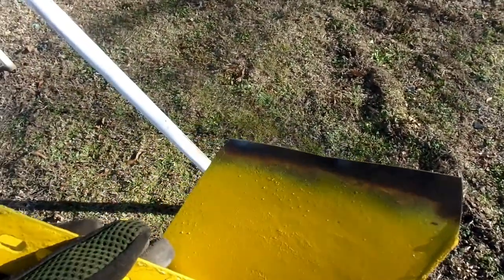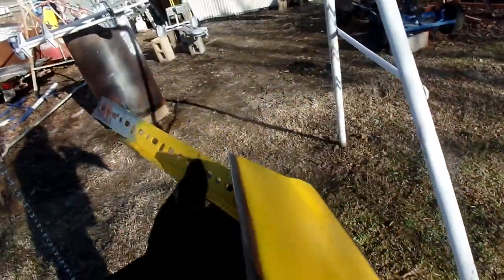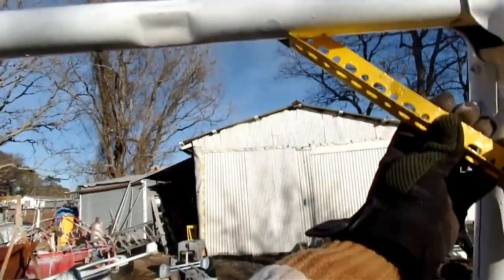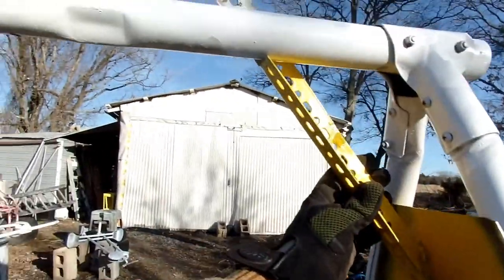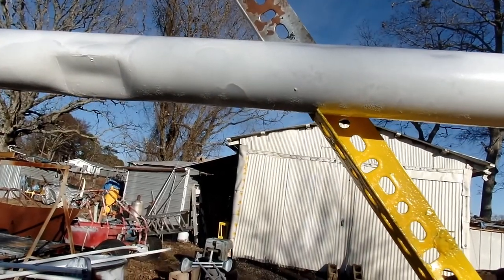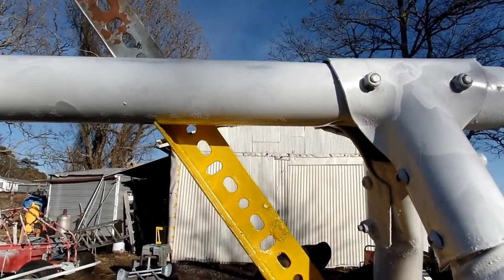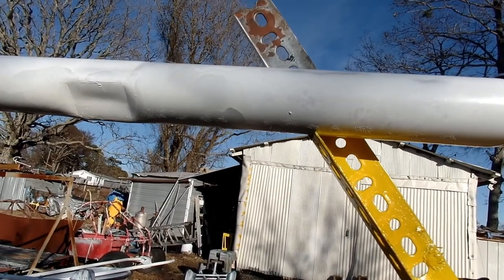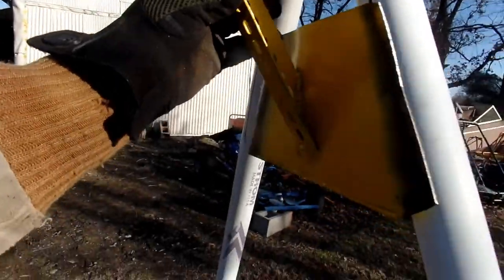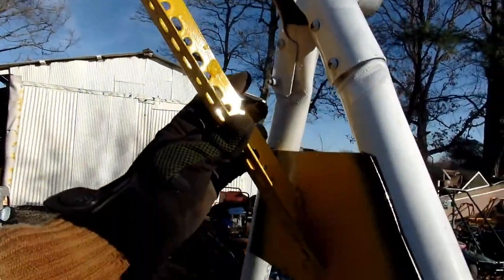I took this over to the wire wheel and buffed the edges to get a clean area, both front and back of where I'm going to weld this. That notch goes right there and this goes like this. The top piece I'm going to hammer down and wrap around that tubing so I have lots of area, and I'll get into those holes and do what's called rosette welding. I'll have all sorts of surface area to make sure it sticks to that tube and comes down here. Once welded, it'll be braced like that so it should never break again.